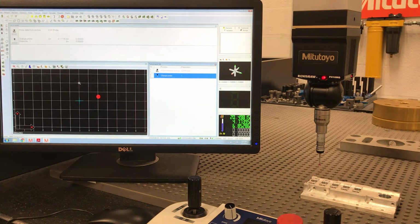I'm just going to put it down and do a manual alignment with a CNC program, so that when I come back up here in 3 months, the program's already written. I just have to redo my alignment. So I've already entered into the learn mode, as you see. The first thing I want to do is the manual alignment.